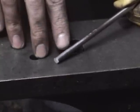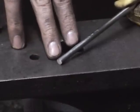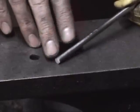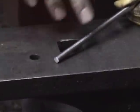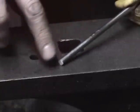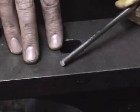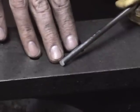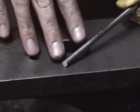The tempering process somewhat reverses the capturing of the carbon atoms inside the structure. So essentially what we do is we loosen it back up to a certain hardness. We quench, we get it as hard as we can, at least beyond the hardness we want, and then we temper it back to the actual hardness that the tool really needs to have to be useful. For springs, that's going to be a somewhat higher temperature. For axes, it'll be a somewhat lower temperature, but it varies.